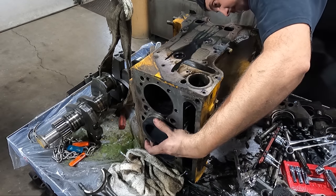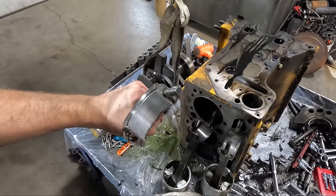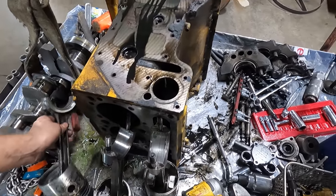Surprisingly, neither of the other two pistons had any broken rings, and looking at the bearings, we see pretty normal wear, with the exception of one rod bearing that was normal aside from one groove where the crankshaft may have a small ding, but nothing catastrophic.